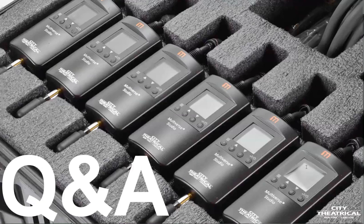That being said, any device that has a radio built into it, you can leave RDM on. So let's take the ETC FOS4, for example. You could get your RDM readouts at all times because there is actually not true RDM traffic. It's MRDM traffic, which will not interrupt the DMX stream.